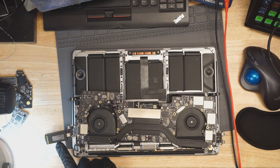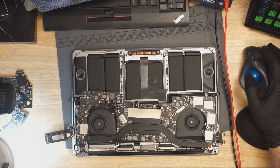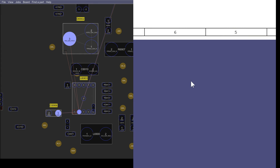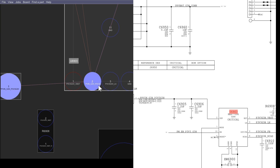It was not communicating with the charger — we could tell because we were getting 5 volts instead of 20 volts on the USB-C amp meter. The first rail that has to be present for this to work is PP3V3_G3Hot. When we looked at that area, it looked like somebody had taken an axe to it. We removed the bad work and noticed the input pad — which is right next to output and feedback — had seen better days, and that's the main input. Since it was the main input voltage for the circuit, it needed a jumper wire. We ran a little jumper wire, it didn't cause a fire, and with that, it works. As always, I hope you learned something, and on to the next MacBook.